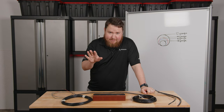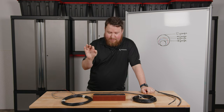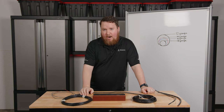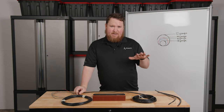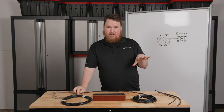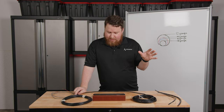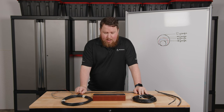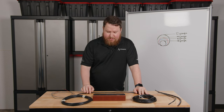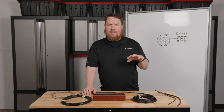So the short answer for speaker wire in a 70 volt system is: 16 gauge two-conductor stranded wire. That is the answer most of the time. But depending on your location and application — new construction versus existing construction — you may also need plenum-rated wire or burial-grade wire. The plenum rating is tied to fire code and construction code in your area.